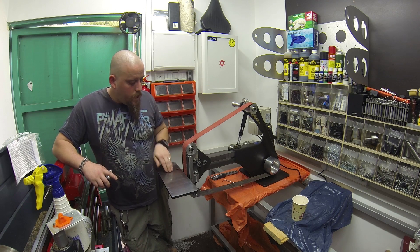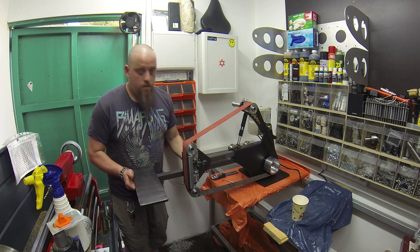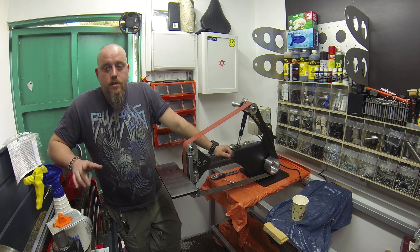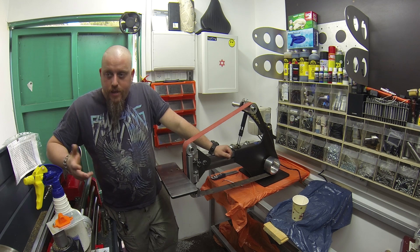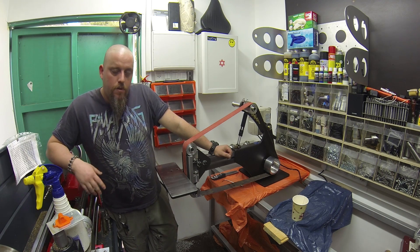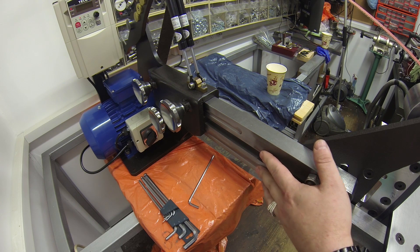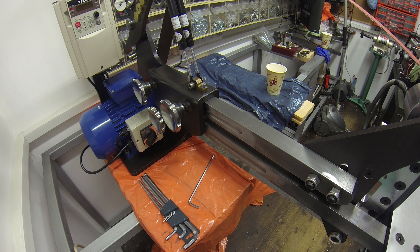The table is independent — it has an independent slot into which it is inserted. So it doesn't matter whether I choose a wheel or a flat plate to work on; I don't need to rearrange my table from one arm to another. It's a matter of a couple of seconds. About the grinder arms: in the bolts I made a small groove 1mm deep, slightly bigger than the diameter of the clamping bolt. This is done to prevent the jamming of the arm in the slot.